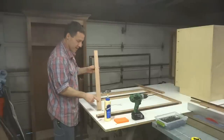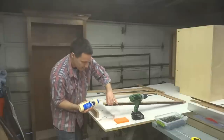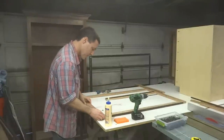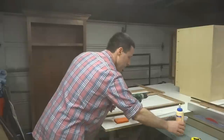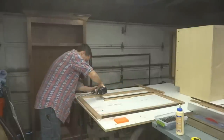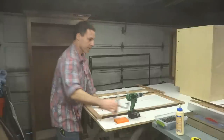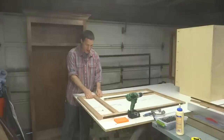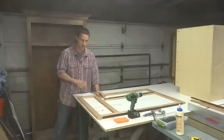This has a few little defect knots in it — very small — but I don't want that. So we'll put a little bit of glue on there, snug it up and repeat. With this done, I'm ready to put in the last piece which will fit just inside, and it just barely fits. I can feel a little bit of friction between these pieces, which is perfect — that's exactly what I want.